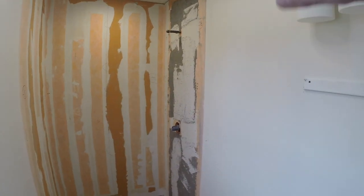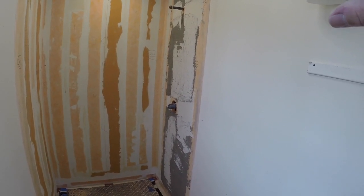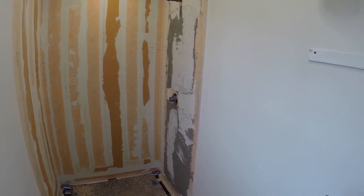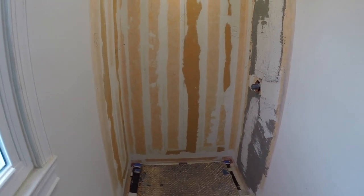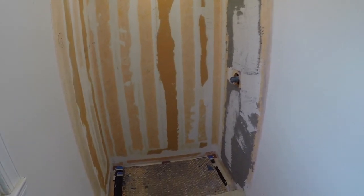We've got to screed this wall, and we use the proper material. In this case, we use Webcrete 95, which is a patch material. And as of right now, it's the only patch material that's made for a wet area on vertical surfaces, not horizontal like a shower floor, but vertical walls just fine. But we've got to lay it out.